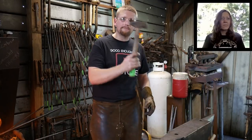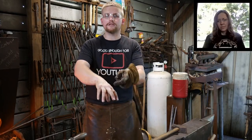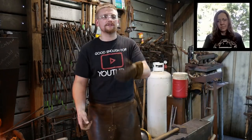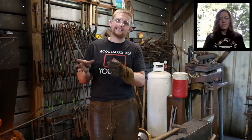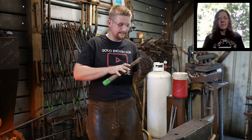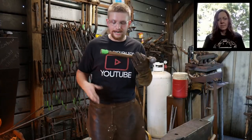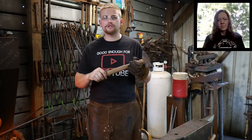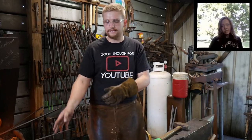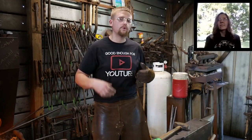There's another one where you stop short to flick at the anvil, and these fingers right in here get really sore. You get a pain that comes and radiates up the top of your hand, or you get a pain coming up your wrist. That's from different things. And what ends up happening is, if you pay attention, as most people do, your body kind of just starts adjusting. You just start adjusting your grip because, hey, that's uncomfortable. That's uncomfortable. And enough of those, it wires it into your brain to adjust your hand, to adjust your arm, to adjust your grip. Unfortunately, though, a lot of times, it's too late. You've already done the damage, and you've done it repeatedly for a whole day, maybe 1,000 hammer blows later. You've already done quite a bit of damage to yourself.